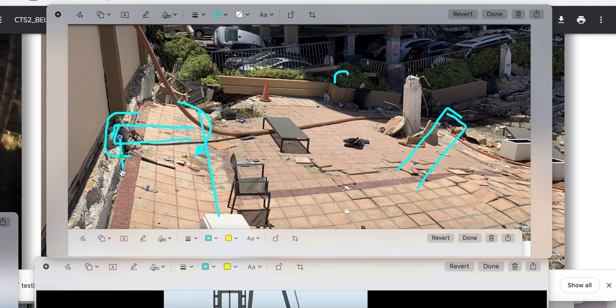Explaining how it was grabbed and pulled away because it was interlocked there. I state that this rebar that's down from the wall surface — I want you to visualize it's going down in the face of this wall system down to the floor, not over to the tile. And that gives it its pinned connection. That pinned connection gives it this rigidity — a strong rigidity — a strong back out to about five feet.